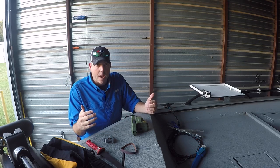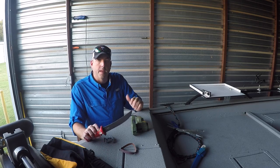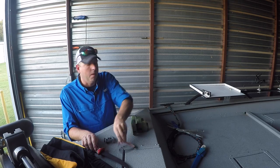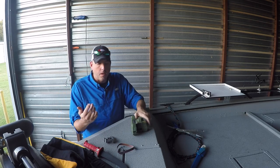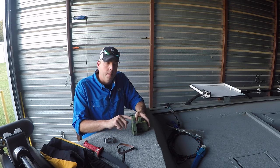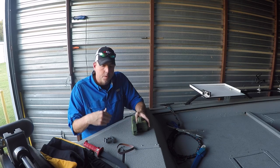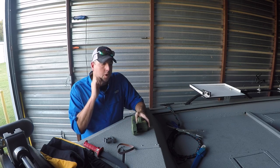About five to ten swipes and the knife is razor sharp on the first sharpening using each belt. Beyond that, all you really have to do to maintain them is just use this fine grit belt, run your knives through there a few times, and it keeps them good and sharp.